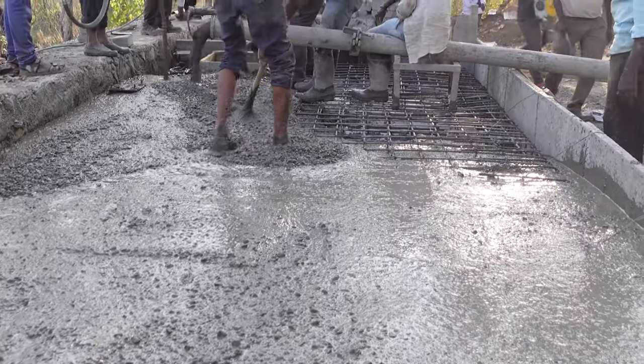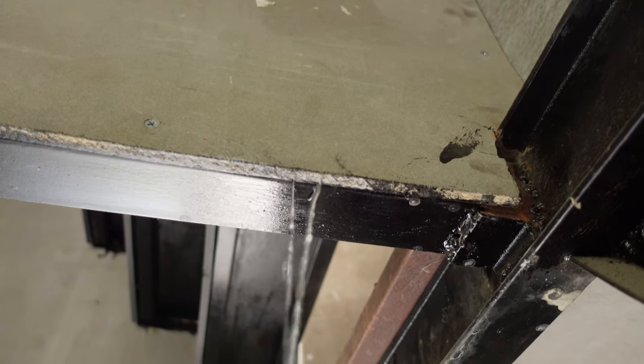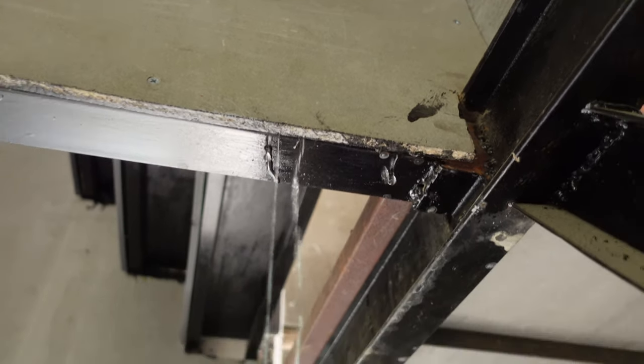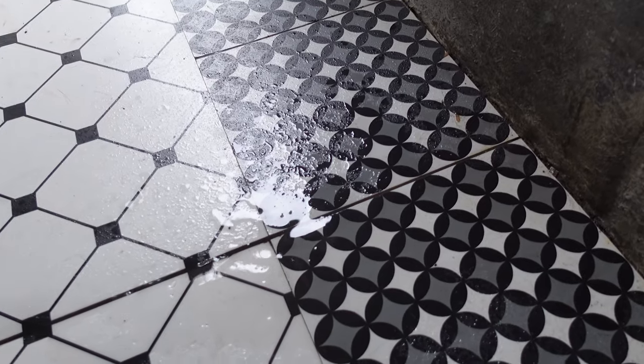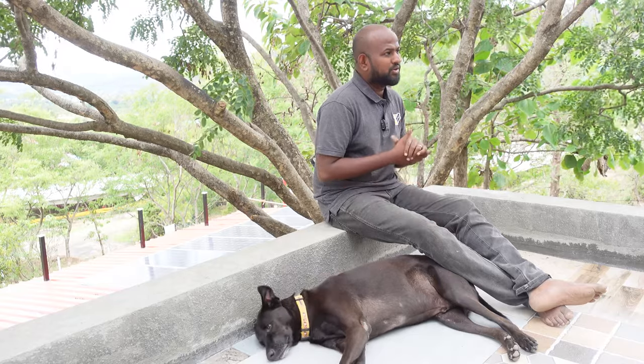It's June, and in the western parts of Maharashtra, the rain starts right on time. Although I had poured concrete on our roof, it started leaking when the rains came. It was leaking from the sand bricks that were used to line the border of the roof. So I decided to waterproof the roof, but with some tiles as well, so that we can use it during winters and summers to get some fresh air.